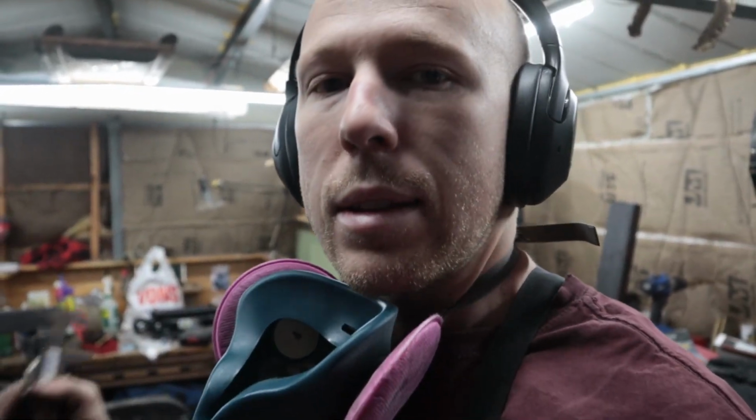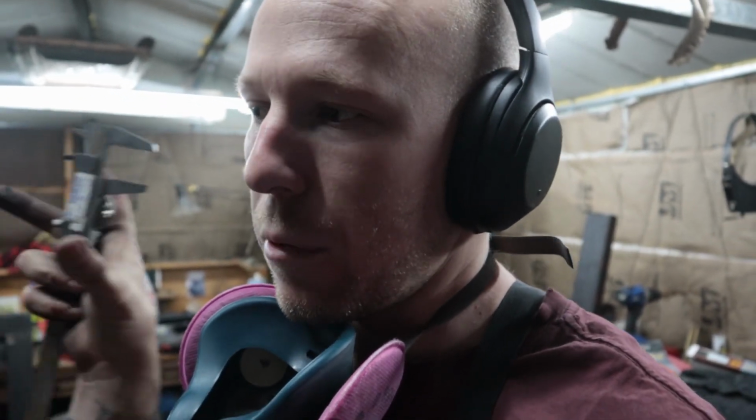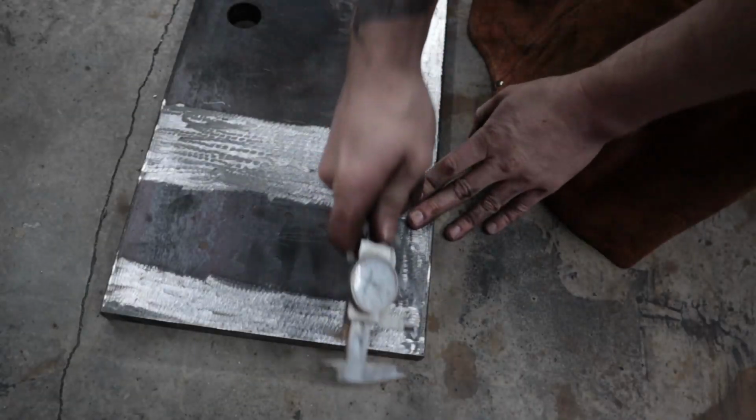edge and scribe a line because I need to bring my angle iron 1 inch on both sides to get me 22 inches. Now the reason for that is because the angle iron is 5 inches wide on both sides, so that's 10 inches. So you take 10 inches off the 22 and it leaves me with a 12-inch working space in between the two angle irons, which is exactly what I wanted. So let's go ahead and get those marked out.